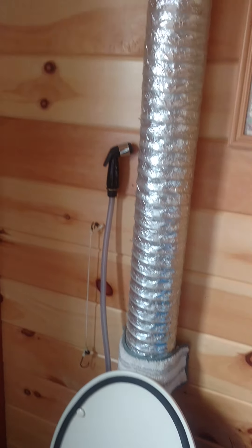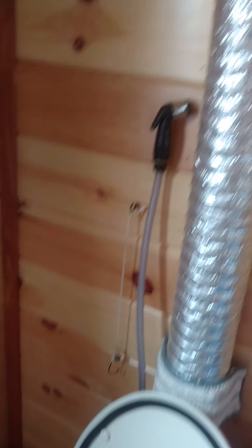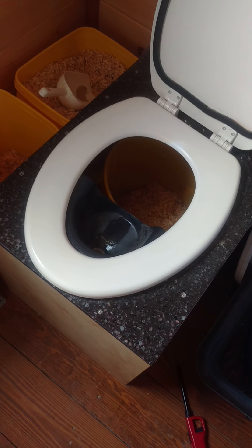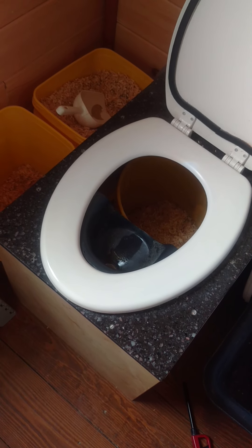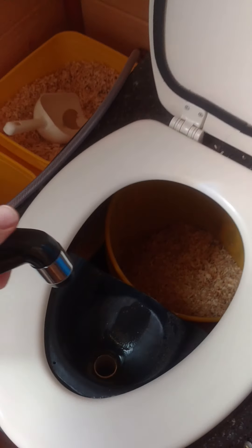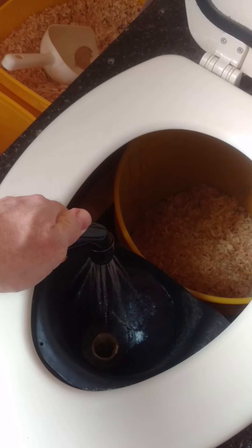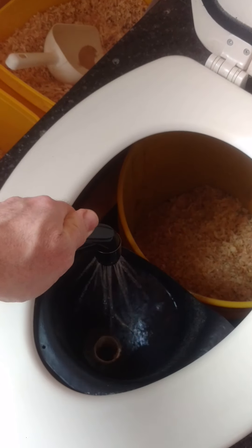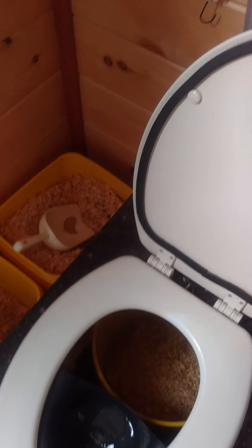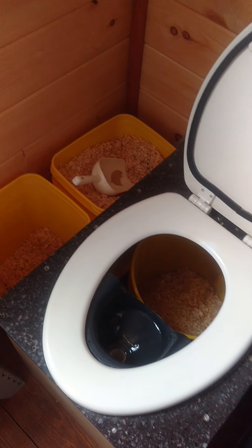There is a kitchen sprayer that I installed on this one. That kitchen sprayer allows me to rinse out the urine diverter, because if all I ever did was put urine down it, it would start to cultivate and grow bacteria. We don't want that because it would close that off pretty quickly and minimize the flow. So this hand sprayer allows me to take my household water and spray and clean that up — rinse out that pee trap the same way that when you flush your toilet you're putting fresh clean water down. That keeps me from clogging up the pipe and prevents bacterial buildup from the urine, and it also dilutes the urine into my gray water tank outside.